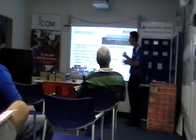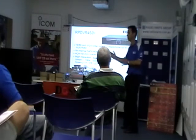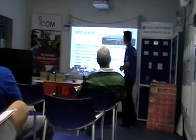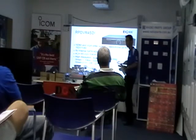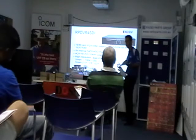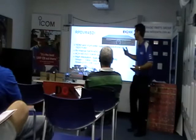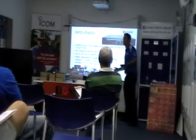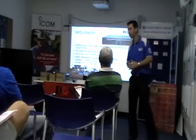So this is the future. We were talking about before how with the HD-SDI you can view it on a monitor, you can now start recording on the DVR. A high resolution dual stream recording, meaning that you can record 1080p onto your hard drive, but if you're viewing it on your iPhone, you don't want to be trying to view it at that resolution. So there is, I believe, two streams. One is at SIF or D1 for remotely viewing, and the other one will be actually recording for playback.